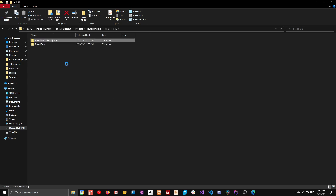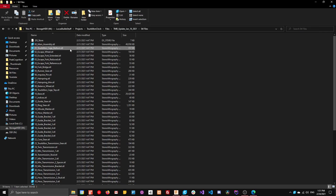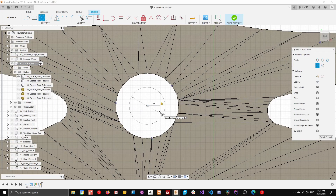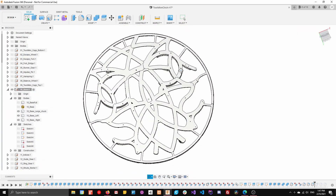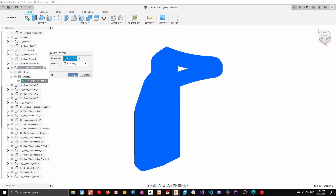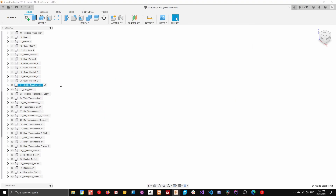At the start, I thought I would just group the parts into three groups. The first being ones I could just scale up on the X and Y axis and start printing right away. The second group would be the ones with pins so I could adjust the pin sizes in Fusion 360. The final group were the ones I needed to chop up into multiple pieces. But pretty quickly, I realized that everything needed to get modified in Fusion 360.